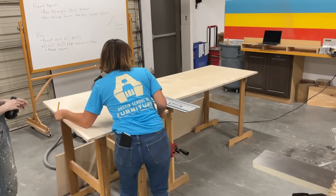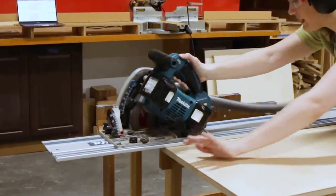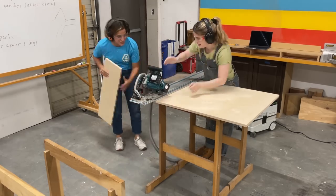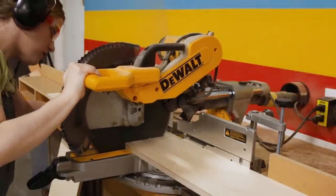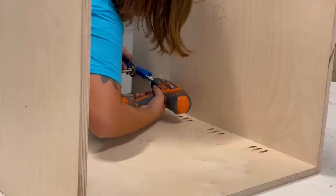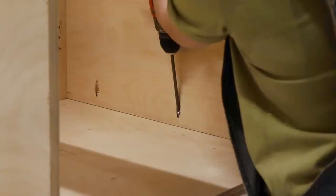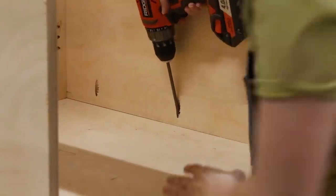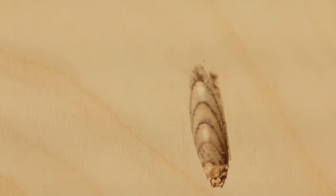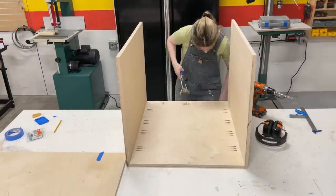We started by cutting out all the pieces for the chair and shelves out of this extra pretty birch plywood. Look at the saw horses, this sick track saw, and the vacuum — this place was decked out. With Amanda showing me the ropes, we breezed through the main cuts and headed over to the radial arm to cut the shelves to length. Then came the real tricks: pocket holes. This is a joining method used in cabinet-making — you use a little jig to drill at an angle through your wood, allowing you to screw pieces together at 90 degrees. The screws are invisible when assembled, so they're basically magic. We used a ton of pocket holes, especially on the main seat and back of the chair.